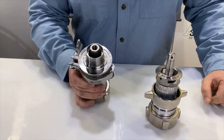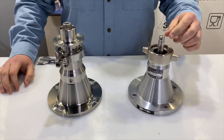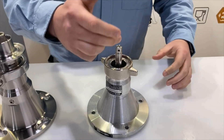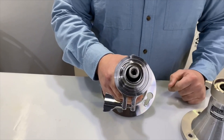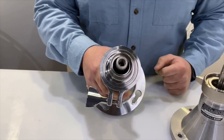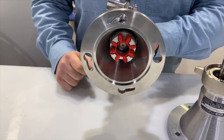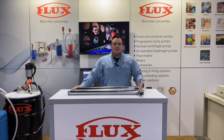Very similarly on the bearing flanges — the F550 is pinned, so the shaft slides over and the pin is inserted through the assembly. The Visco Power has a threaded drive shaft which the pump shaft threads directly into. You can also see the bayonet-style design, which allows you to break the motor bolts loose, back them out slightly, rotate the entire pump assembly, and slide it off the motor.